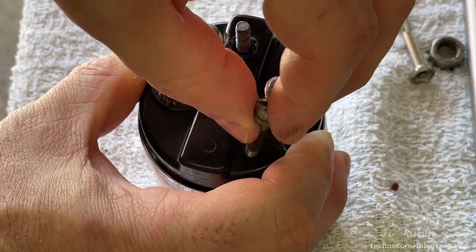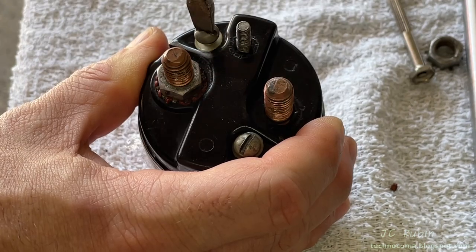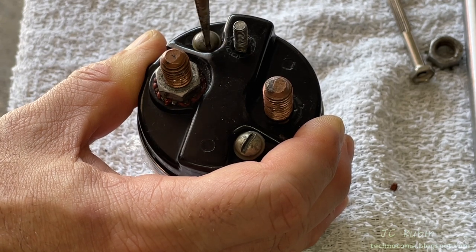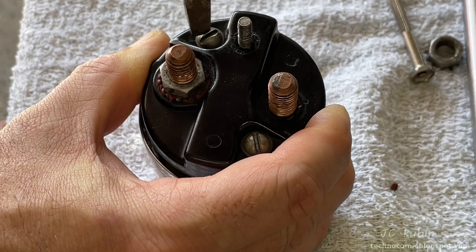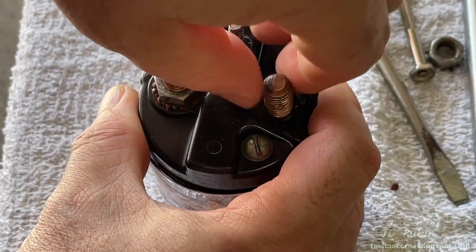The flathead cover screws are reintroduced as the cover is held steady and these screws are tightened down. The first one is tightened only to draw out the slack, then moving to the second screw and tightening that down, then coming back to the first. The studs are then rechecked to make sure they're sitting properly and not rotating — fully seated.